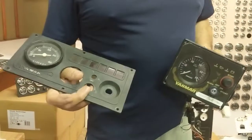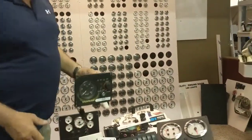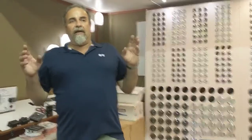This C panel uses a siren and a push button. These panels are designed so that if the engine alarm goes off for high temperature or low oil pressure, it lights up. If you lose your alternator it will also light up, telling you that you have a dead alternator or your belt has fallen off. These are simple panels, but the engine comes with only idiot lights — low oil pressure alarm and high temperature alarm.